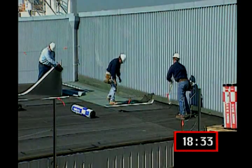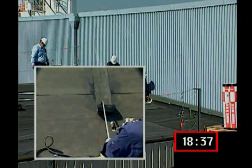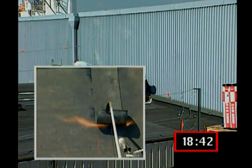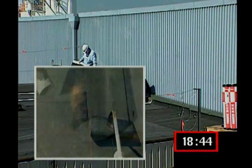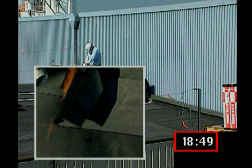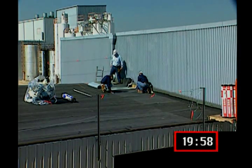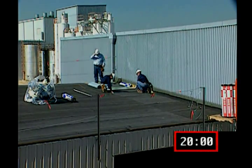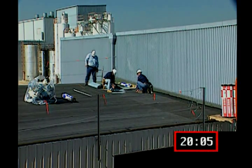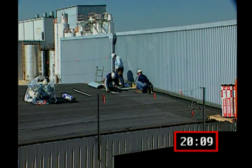In all applications using self-adhesive Siplast Paradiene 20 products, end laps, critical areas in any roof system application, are torch taped or torch welded with Paradiene 20 TG. They can also be completed with cold adhesive to ensure watertightness. Siplast's conservative, redundant approach to details applies to applications using a self-adhesive Paradiene 20 base ply, so detail requirements will be familiar to any Siplast Select contractor.